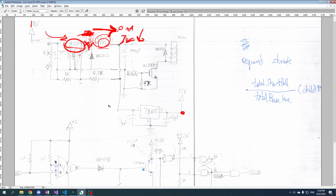Now, there's some problems that need to be overcome. So in this case, cutting off that flow here doesn't mean that it goes to 0 volts. What it actually means is that this connection here is completely severed. All right. Now, the funny thing about your inductor is once you got it spinning, and let's say it's got 1 amp of current going through it, for simplicity's sake. If you just try to disconnect the circuit here, at that instant, it can't just instantly drop from 1 amp to 0 or anything like that, right?